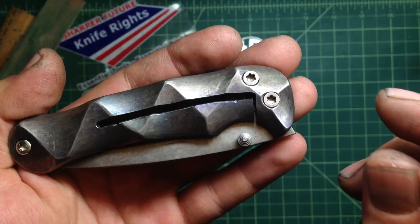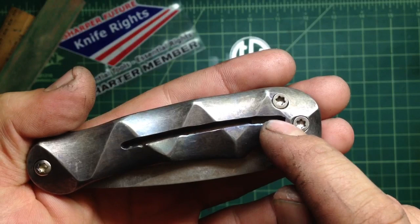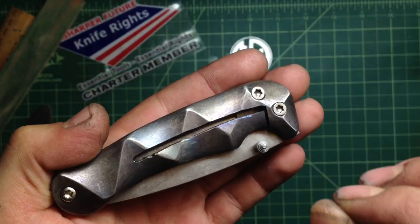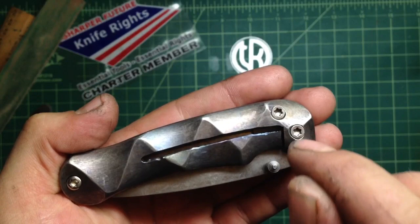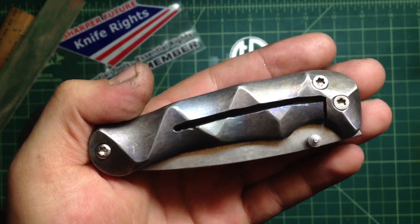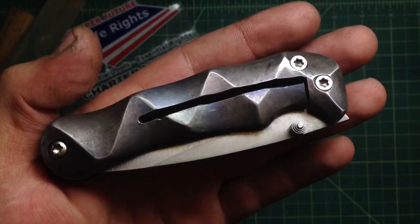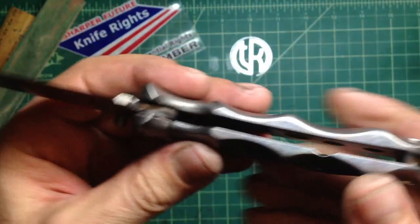I marked the end, marked the corner, made the cut with the bandsaw and drill. Drilled these two holes — the corner one and the end one — and then I took a Dremel with a diamond wheel and made a nice groove so the drill bit would grab in the exact location I wanted. Then I just drilled hole next to hole next to hole, then took a bunch of different diamond wheels, deburring wheels, and carbide tips for the Dremel and cut it through.